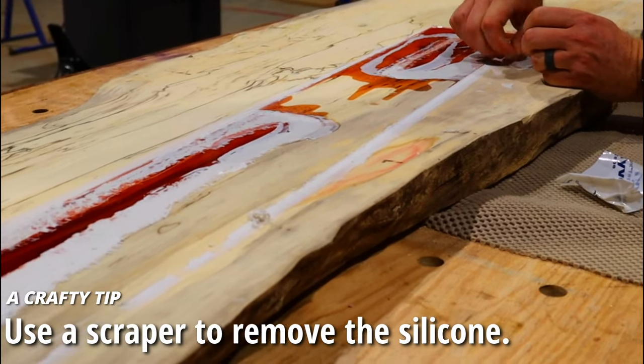As for the edges, just take your gloved hand and smear the epoxy on the outside live edge, making sure everything is coated. We use the same torching regimen as the casting epoxy — torching immediately after application, 15 minutes after that, and 30 to 45 minutes after that. That should take care of all the bubbles. We do this three times total, sanding lightly at 220 to etch the surface between each seal coat, following the same torching regimen.